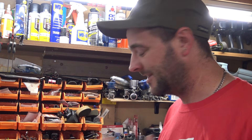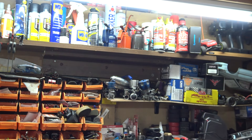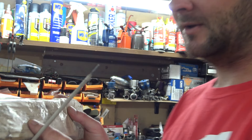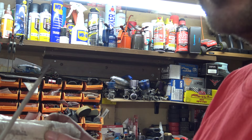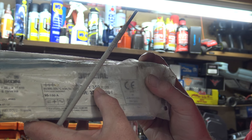I've got to stress - this is just for fun, this is just an experiment. I'm not seriously trying to get these rods to work well because if I wanted to do some proper welding where I needed it to be good, I'd just go and buy some new rods. This is just for fun. You can use them without baking them, but you're supposed to bake your rods. In fact, it says on the packet: bake for two hours at 300 to 350 degrees Celsius. These will work at 95 to 150 amps.